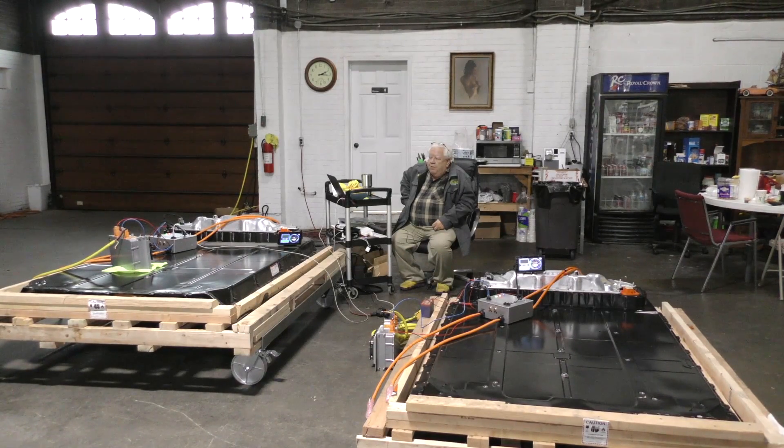Conceptually, this is the model I like — using full EV voltages — because the currents are so much lower. We can do a 20 kilowatt inverter at full power at about 50 amps at 350–400 volts. To do that at 48 volts using the modules is over 400 amperes, and the I-squared-R losses in the cables are unmanageable at those power levels. That's why we really can't go above about 15 kilowatts with the Sigineer inverters.